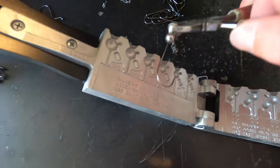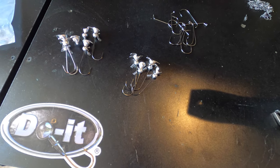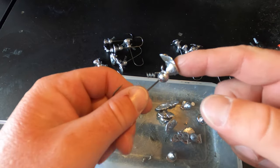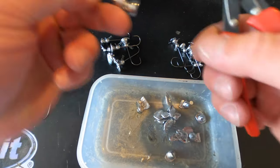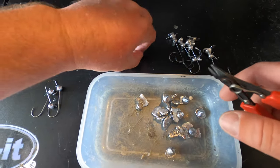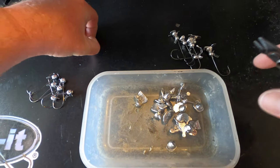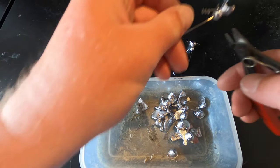I'm going to do at least two more of each off camera — I have a total of five of each. So we've got five three-sixteenth ounce and five eighth ounce shaky heads. This extra piece on top is called the sprue. I like to leave a little bowl underneath to catch all the sprues so I don't have to pick them up — and then I can pour all that leftover lead back into my pot to reuse it. Lead is great that way: if you screw up or have extra, just pour it back in and it melts right down.